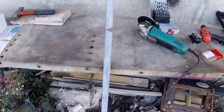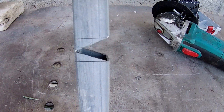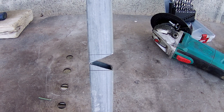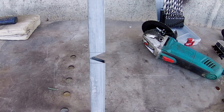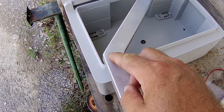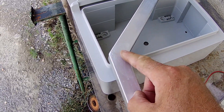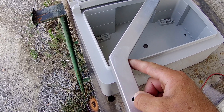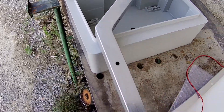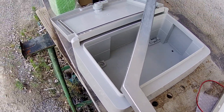I've got a V cut here — I'm going to bend this steel over to the right to give the correct pitch for the solar panel so it faces the sun. I cut the V out, folded it, and then welded it. This is galvanized steel so I had to clean some of the galvanized coating off before welding. If you weld galvanized steel please be careful — the fumes are poisonous, so make sure you've got good ventilation. After welding I sprayed it with silver wheel paint to blend it in and keep the weather out.